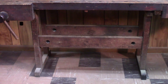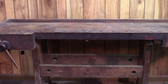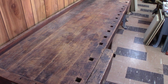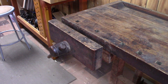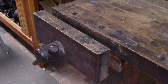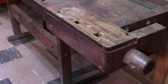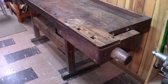This is a pretty typical cabinet maker's bench. It has a sled foot trestle style base. The top is a solid slab glued up from two and three-quarter inch thick maple strips. Running along the front edge is a row of dog holes and at the back is a tool tray to set your tools while working at the bench. At the left hand end of the bench is a face vise, typically used to clamp a workpiece either on edge or vertically between the jaws for tasks such as planing an edge or cutting dovetails. Then down at the right hand end of the bench is a tail vise, which allows you to hold workpieces on top of the bench between a pair of bench dogs.